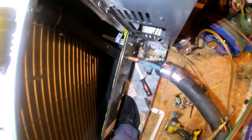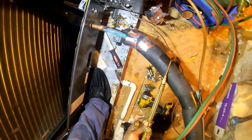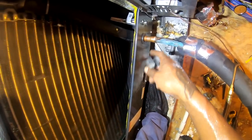But a fire extinguisher, man. Cause I have had these things, a little oil still left in there, and it'll blaze out on you. More on a commercial job, but it has done me like that on residential also. I think I witnessed somebody use a fire extinguisher one time. But imagine you putting a fire extinguisher in here, man, all that stuff gonna get in your line set.